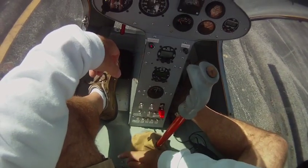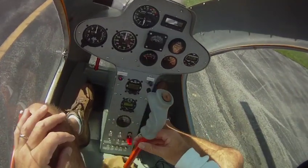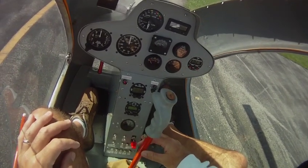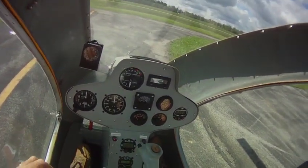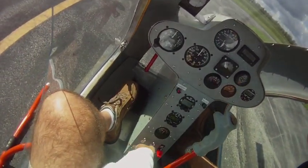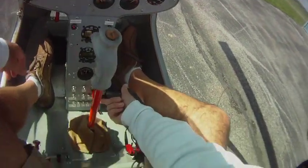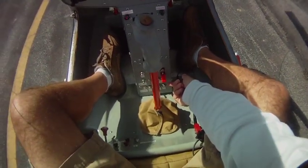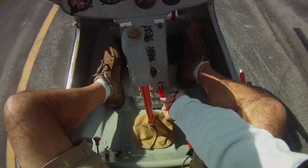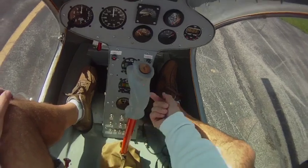We've got the fuel on, we're ready on the clutch. We're going to flip on the fuel pump, the aux bat, the regulator. I already got the radio on. I have a guard over the governor here, and the reason is I don't want to shut it off in flight because it's needed in flight. You shut that off and the engine spools down — not a good idea. So we'll turn that on.